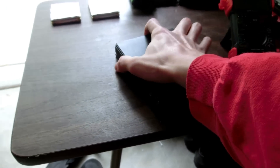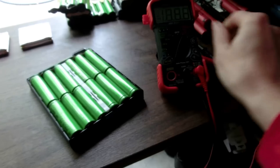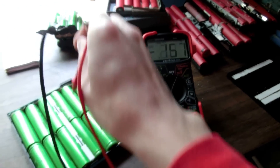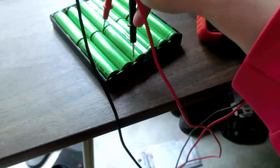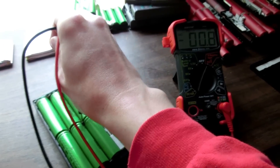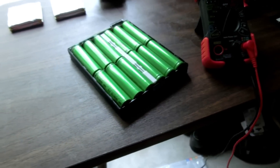But then I opened it up and surprisingly enough this one actually has some surviving cells. Three volts... two volts... three volts again. I think this cell's dead — yeah, that one's dead. So these three cells are dead, but these nine cells are still good. Let's look at the date code.